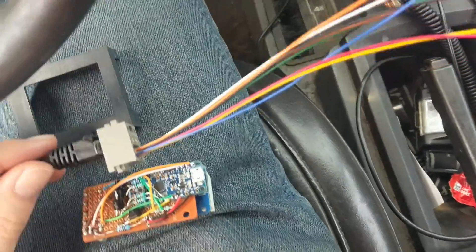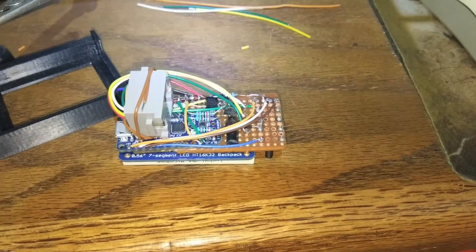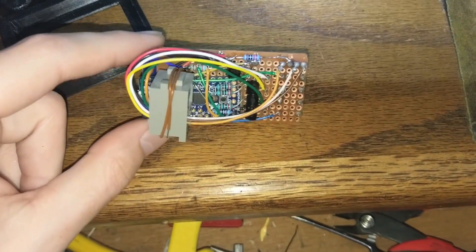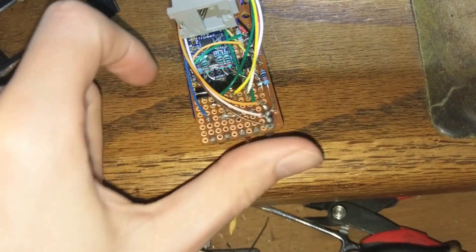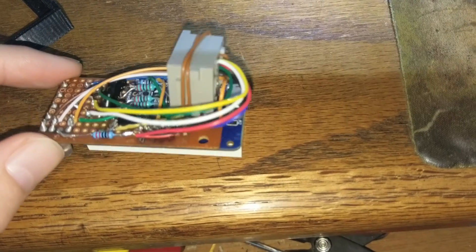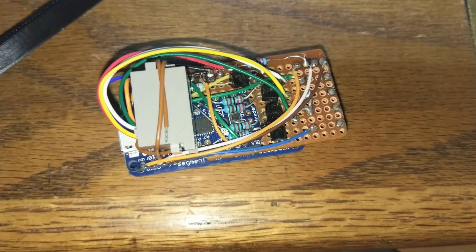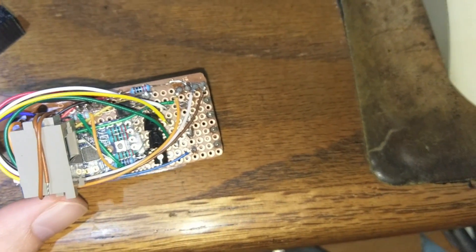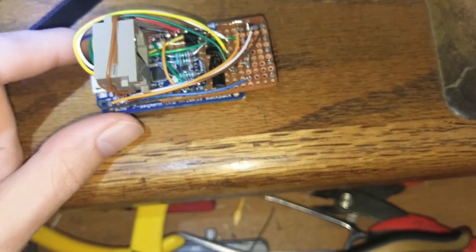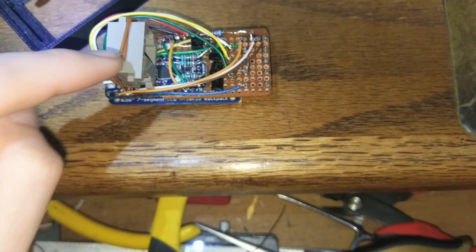We got the wires right here we can run to whatever we need - we'll just snip the cable and run them to everything else. That actually fits in there rather nicely. We've got all our lines: three fan outputs for the coil ground, the blue one is the AC input, positive power, ground, and 12-volt in to the VIN pin. That should be everything and we still have a spare wire - oh wait, that one more thing is for the temperature sensor. All eight pins are being used.